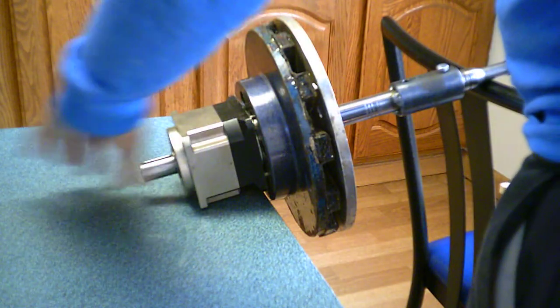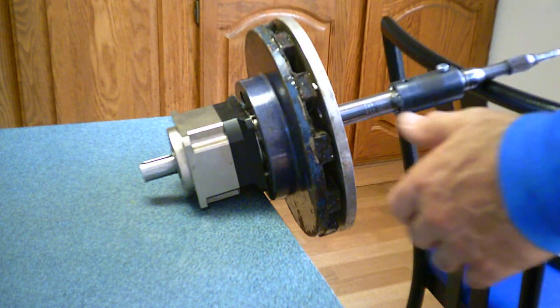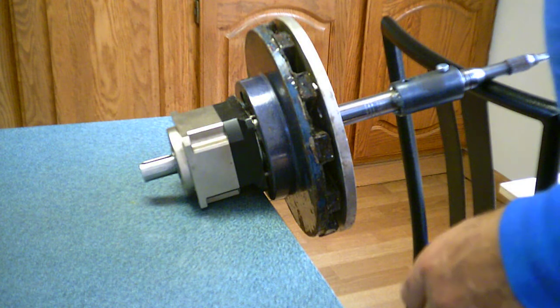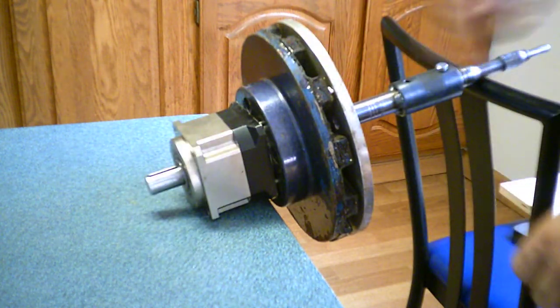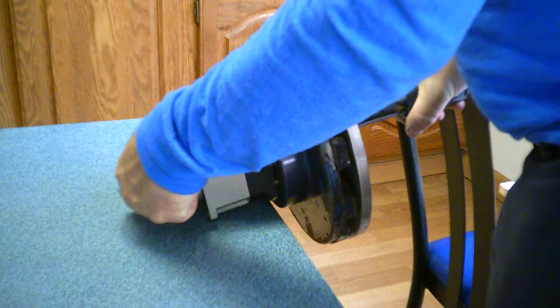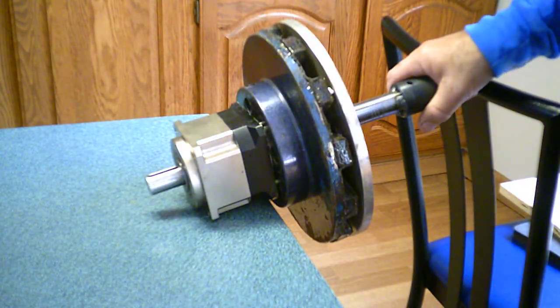All else being equal, if this was in the truck, there's a further 2.2 to 1 reduction at the differential to the back wheel past here. So I need a much smaller unit than if it was taking the entire force of the wheel — it's only taking half the force. In the normal course of events, this would be affixed to the body of the truck. But what we have instead is these are free spinning. So if you turn the motor, the truck won't move because it's easier just to turn this gear. It'll go backwards 4 times instead of the truck moving forward — at 1 quarter speed instead of the truck moving forward at 1 fifth the speed of the motor shaft.